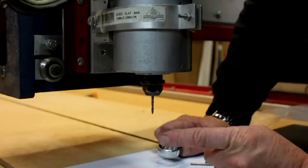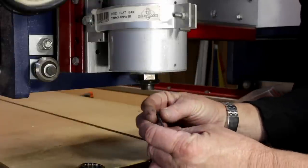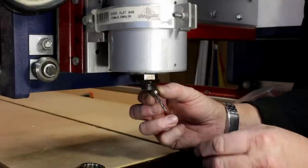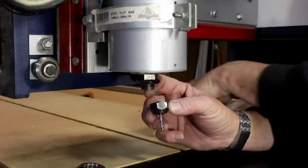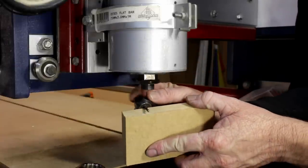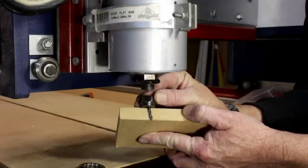Now, there's an easy way of setting those. What I've done is I've added a small O-ring to the very top of my router bit. I can now drop that into the collet and drop the collet into the collet nut and it will all stay together in one place. I can now get my piece of stock that I want to cut and check that there's enough router cutter sitting through there to cut through this material without problem.